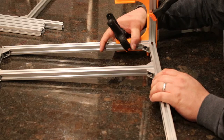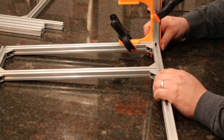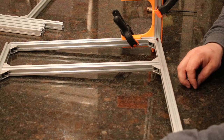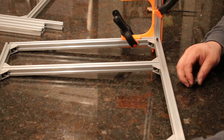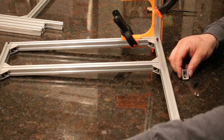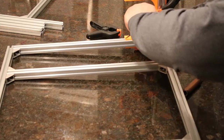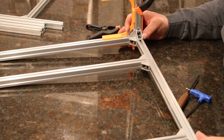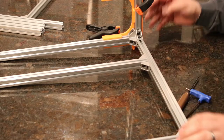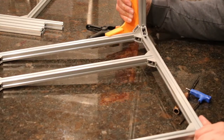We have the side clamped to the jig, and one of the 440-millimeter 2020 extrusions going up vertically. Take one of our corner brackets — we have to put it in two planes now. We're going to put one here and also one here, and that's going to rigidly hold the component in place. With the corner bracket in place, we've got three aluminum brackets holding this corner together, making it extremely rigid. That rigidity is going to be a big part of why your prints are going to look so great when this thing is done.